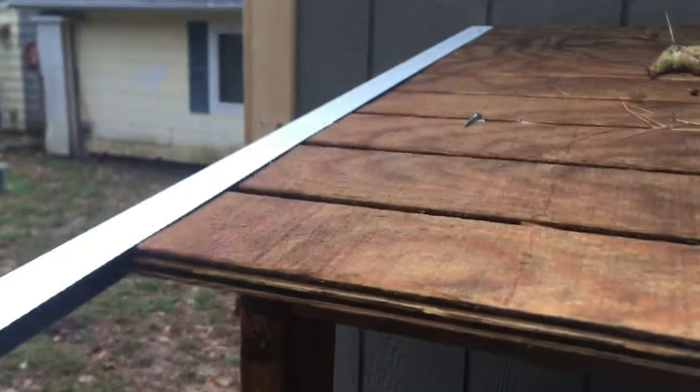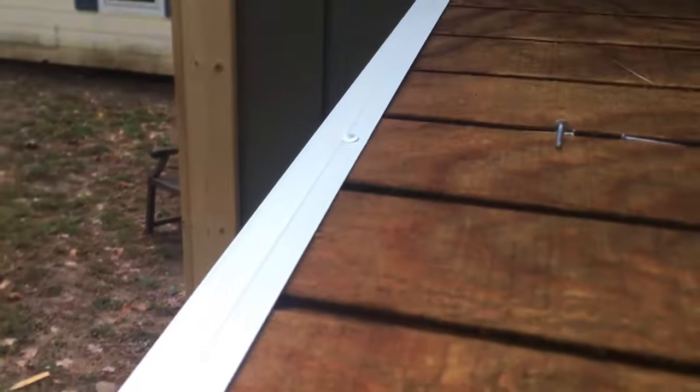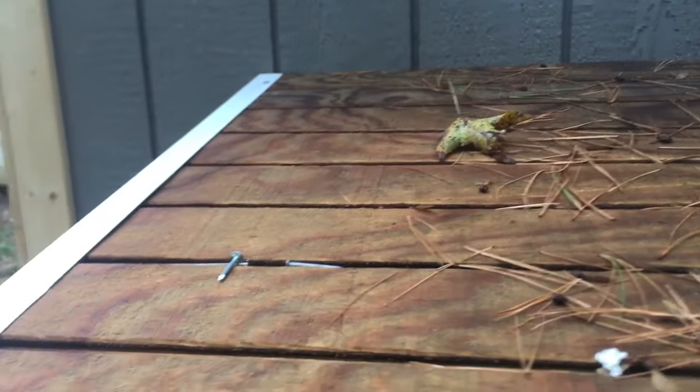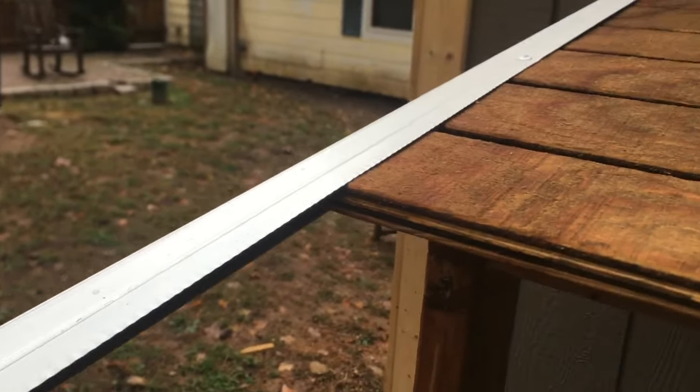You want to get it up here with just a couple of nails, because if you're going to do shingles or starter strip, you'll have a few nails to catch — but you only need a couple. When you get to this corner, you're going to need some snips.